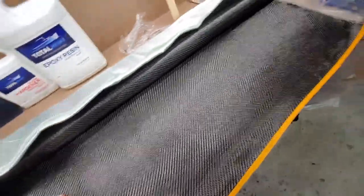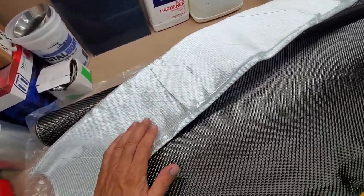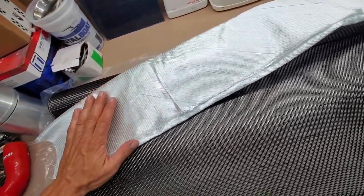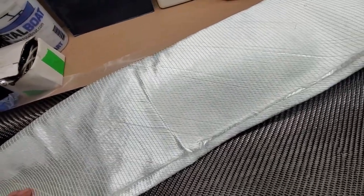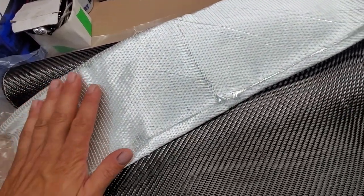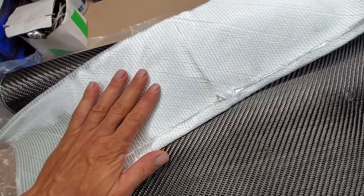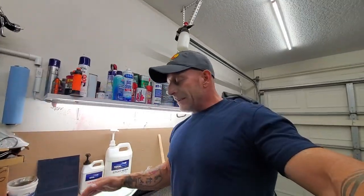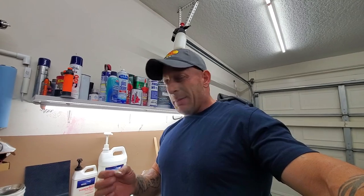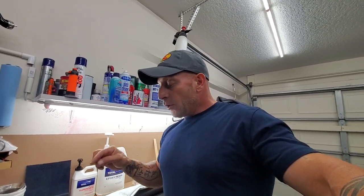The schedule of the layup is kind of my own recipe. For the center, if you're ever going to work with composites, this material is the heavy hitter — this is 1708 biaxial three-quarter-ounce mat. It has woven mat on one side and chop strand on the other. The 1708 is really strong. When cured up with the carbon it'll probably be around five millimeters thick, but you'll be able to park a dump truck on top and it won't break — very strong and very light.